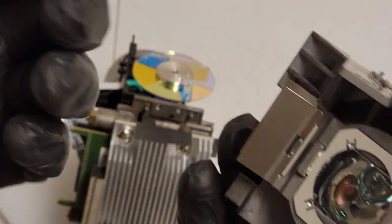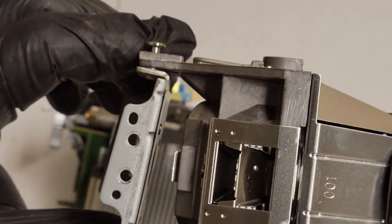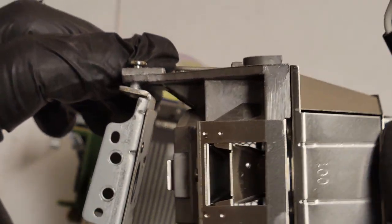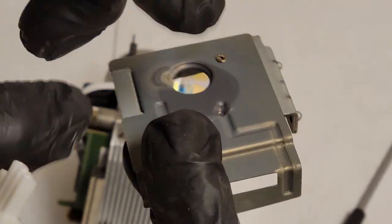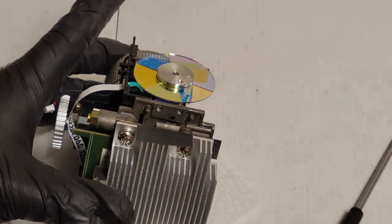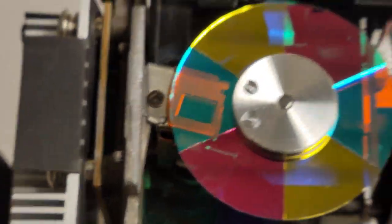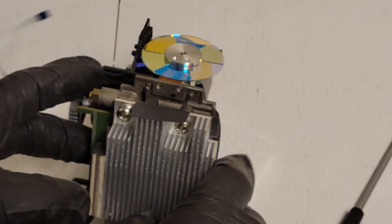Now, if for some reason you have a shadow, some of the things to look for is to make sure that your lamp is not tilted like this, either way, or if this outer shield, this thing here, moved, though it's kind of hard for that to happen. The other thing could be the light tunnel. There's that metal shield there. They can get hot and warp sometimes, but mostly I would just make sure the lamp is straight.